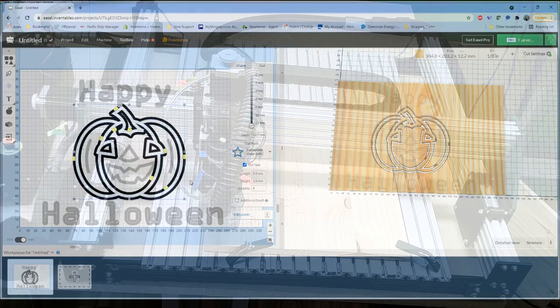For those people that have ordered the expansion kit and are wondering about spoil boards for that, unfortunately, with the 1x1 meter expansion kit for the Silverback, an MDF spoil board is not a viable option. There is too far of a span and it would allow the MDF to sag in the middle, therefore you would not get accurate cutting. So, at the time, we are telling people that you will have to fabricate your own spoil board. I know our own team member Jeremy is working on a spoil board for his using 1x6 lumber. We do have an aluminum spoil board bed assembly for the 1x1 expansion that is due in about a month. We're expecting those to arrive in early December so that we can start getting those shipped out for those individuals that have already either pre-ordered them or want them for their machine.